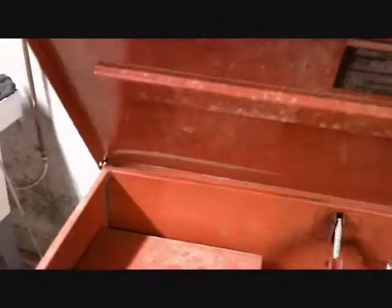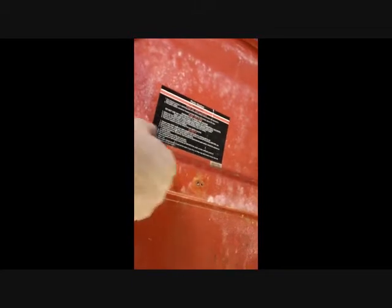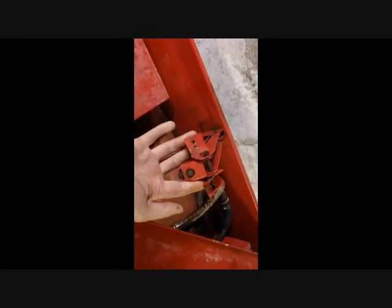Back to the project — I was able to take those nuts off, the threaded rod comes out, and now I can take this cover off. I also discovered I had damaged the unit responsible for holding this open. I was in the process of removing this when the camera died. See how these brackets are all bent up? These were screwed to the underside of the lid. There's a screw there and a screw there that sheared off, and the other two screws partially pulled out. There are supposed to be two screws in each of these, so I'm going to have to reattach these brackets to the underside of the cover.